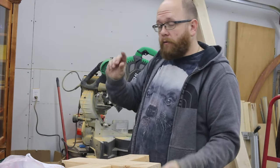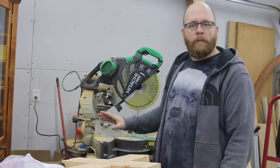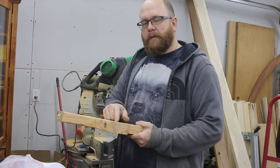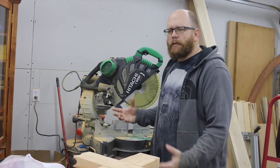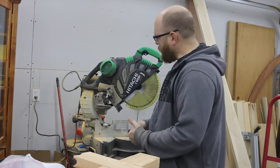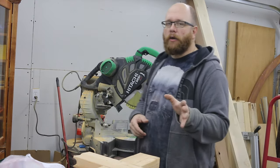What I ended up having to do was take a piece of plywood and lay it across the bed to pad it out so when the blade cuts through the dado, it makes the same depth all the way through. I'm not sure how useful this feature is actually going to be. Now that I've tried it, I still might find some repeatable operations where it would be useful, but as of right now, my table saw will still be my go-to for making dados.